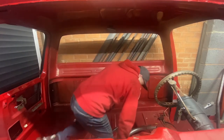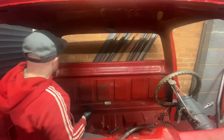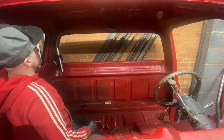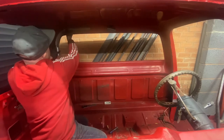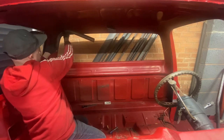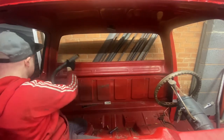Right, so we know now that that's 975. Then you start both your bends. Obviously your bends make it longer, and you'll get down to here where you need another straight section. So you can work that out roughly again by the same process, because you know that's going to be roughly in the corner. So what you can do is bring that down to where this part's straight, and again do the same thing. Now I've marked this previously, so mark it on there where your bend starts, and then again where you think it's going to need your second bend to straighten out.